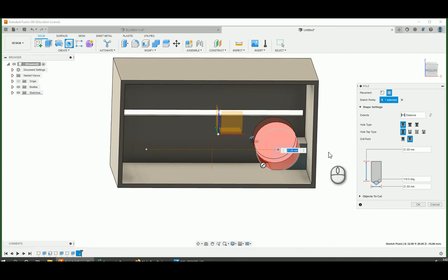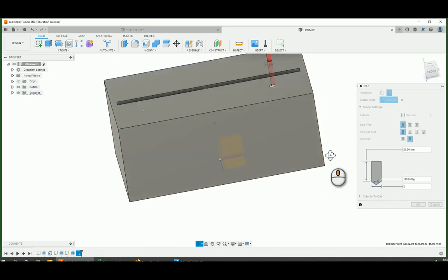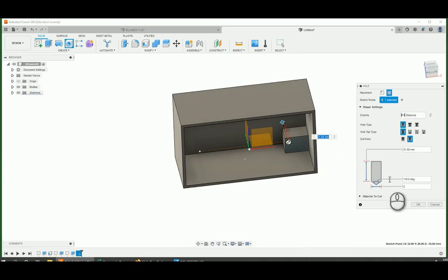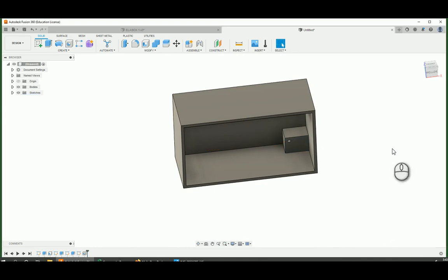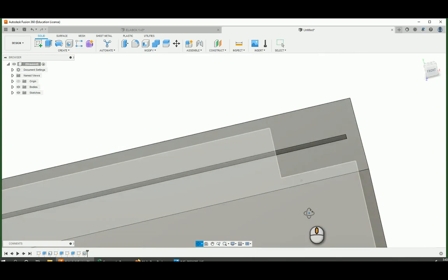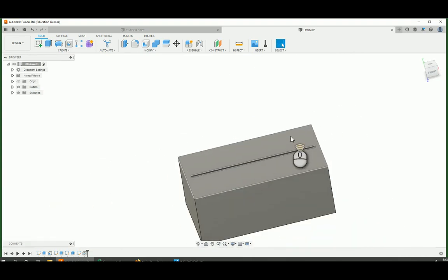Now that that point is there, I'm going to finish the sketch and create a hole. There are lots of different ways of punching a hole through something — we could make a sketch and make a circle — but let's use the hole tool and place it on that point we've made. The diameter of the hole is currently set to 21 millimeters — that's not what I'm looking for. I want a two millimeter hole, and I don't want it to plunge through everything or come through the top of the box. So instead of going that far, I'm going to tell it to go a distance of 10 millimeters. So now we've got a hole that's plunged through but not popping through the top.